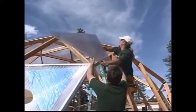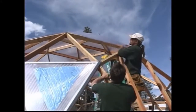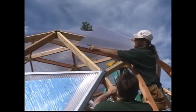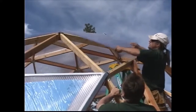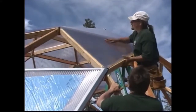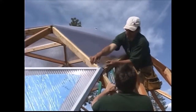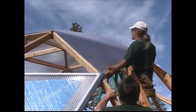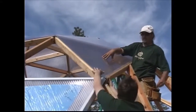So when lining up your glazing triangles, we have a dot already on the glazing that represents the point opposite the B side, and it also shows you the outside of the glazing. So when placing, this is a C2, we're trying to go about 1/3 of the way over your bolt, so that there's 2/3 of the bolt showing, between 1/3 and half, and you want that equal all the way around. Once it's equal, someone holds it, and then you put some screws in.